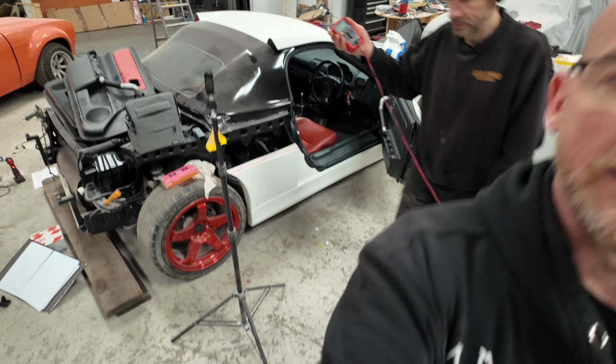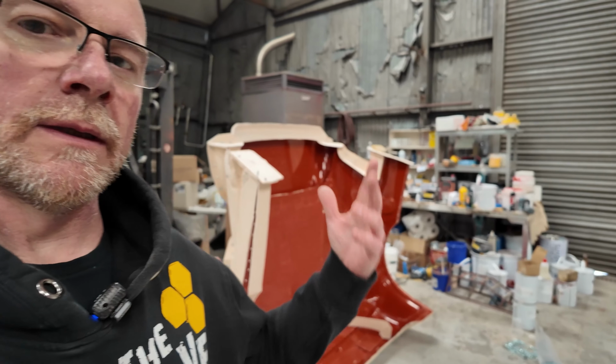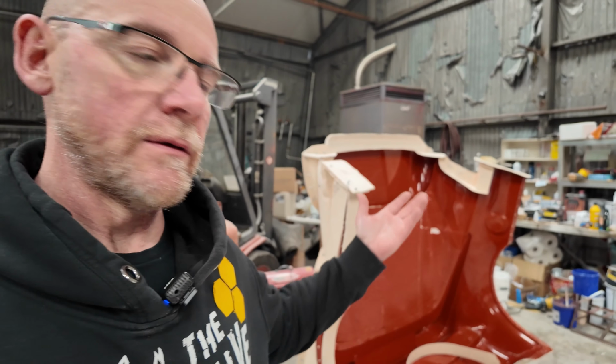And there's the RB200. Still working on the clam, putting that together, doing the bolts. It's all sanded and I'm just assembling it now. So today I'm hoping to get the plasticine in all the joints and the PVA release agent on it. If I get that far, then I'll be happy. I'm probably not going to go any further, because the next bit would be to start casting fiberglass into it, so I'll leave it after that.